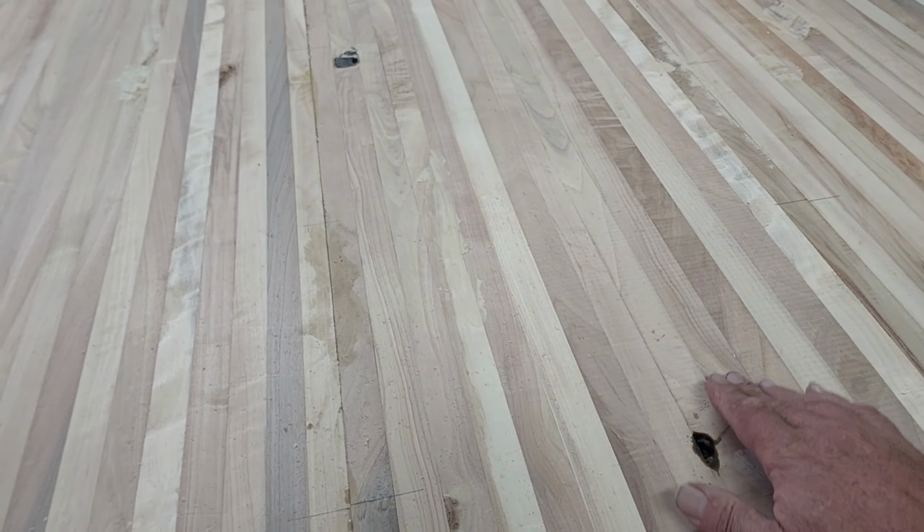So guys, a few hours later, the top is now sanded to 120 grit right through. I've done on the corners a little 3mm roundover on top. And then I also just sanded a little sample block to see what the Rubio Monocoat Pure is going to do. So that's the color difference it's going to be. I think it's going to look very nice. I'm not tired of sanding, so I'm going to continue now assembling the other bench.